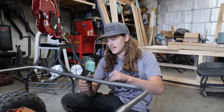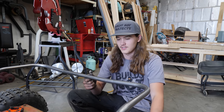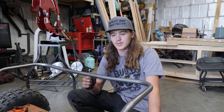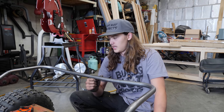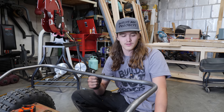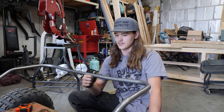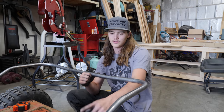The last two bends were kind of a pain to fit in the bender — had to take the roller die out to get it back in. I definitely could not have put any more bends in this thing. There are 10 bends now in this 10-foot section of tube, and honestly I can't believe I made it work. I was skeptical at first that it was going to turn out right, but I think it did pretty good. Now we've got to cut the front sections off and get it all tacked in place.